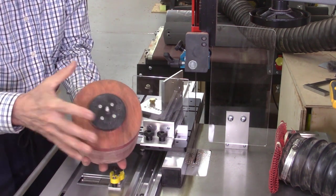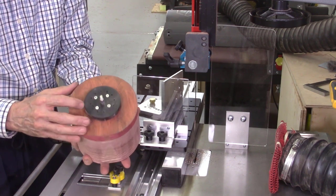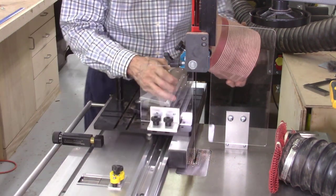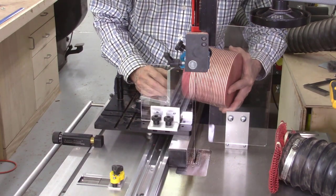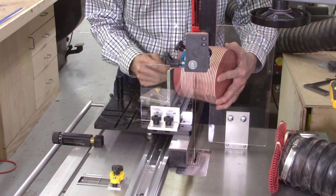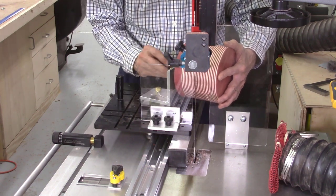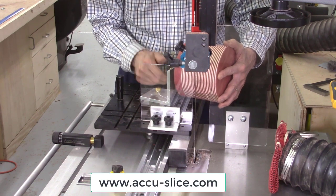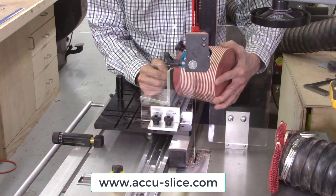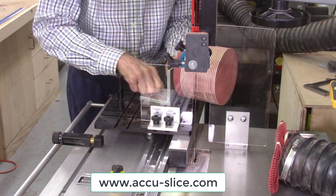And I mounted my pattern disc, which is a 12 position pattern disc, and I centered it on the bottom of this jig. Cutting the facet requires the Accu-Slice index table, the Accu-Sled, and the Accu-Facet accessory. I'm going to be alternating every second step, so it'll be 6 facets per layer. For a more detailed description of cutting facets with the Accu-Facet system, see the other YouTube videos listed in the description of this video and on our website.